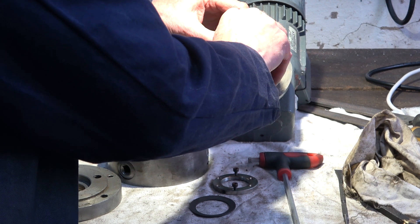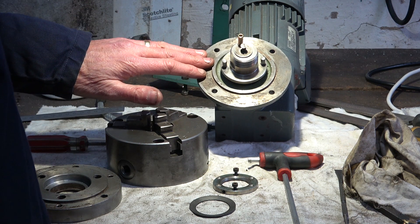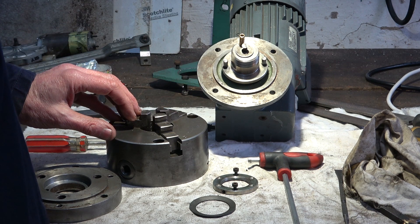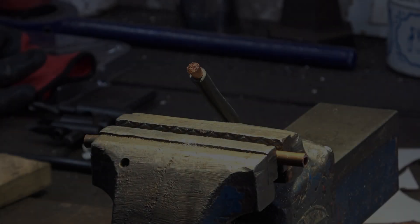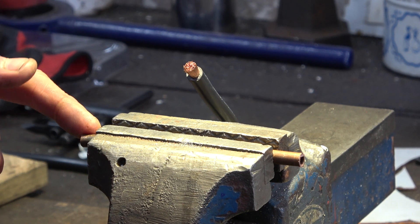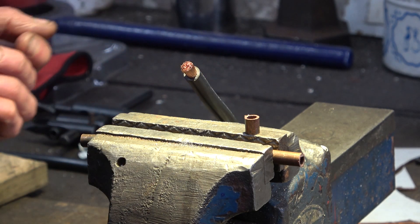Everything is now made. All that remains is for me to clean it up — I'll take it to the house to warm things up so that the glues and silicone work to their best — and put the whole thing together. Then we'll come back, connect it up to the inverter, and you can see it spin. I'm just making a sleeve to go on here — I've cut a piece of 8mm central heating pipe, I'll drill that out to 6.5 on the lathe, slip it over, and try to solder it.